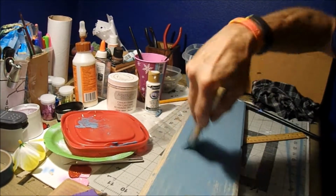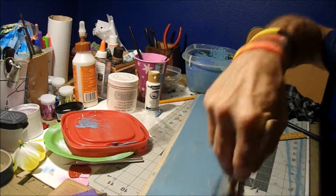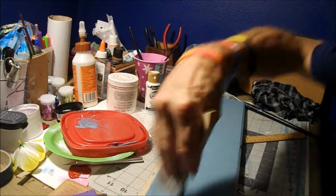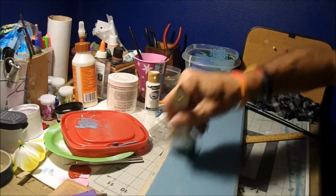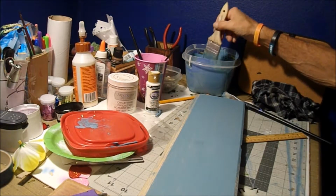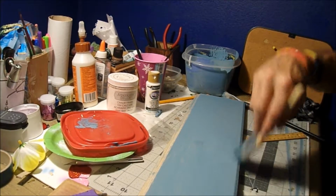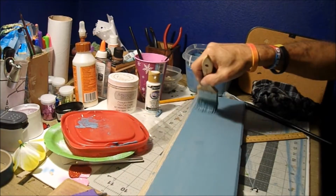Extra there, got a little thin, and this stuff dries pretty quick. With that Durabond in here, it helps absorb the moisture once it hits the air. And Durabond dries quick by itself if you ever work with it, like plaster of Paris or any of that. When you add warm water to it, as the temperature goes up, which it is warm in here, it's drying quite quickly. And I have a fan running in my room here in the window, so the air is coming out.